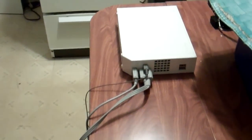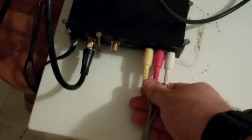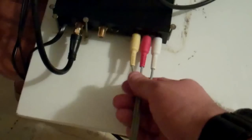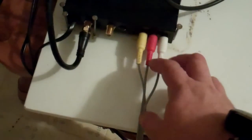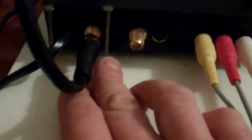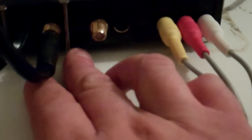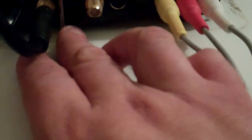I have the Nintendo Wii for the sake of demonstrating what I did back in the day with the 8-bit system. Using composite video and this device — composite in — it converts it over to a radio frequency. You have a choice between channel 3 and 4, and you have your ohm switch, which I've never touched — it doesn't seem to make any difference.